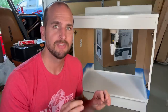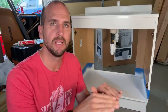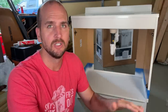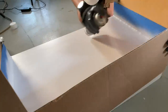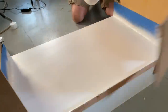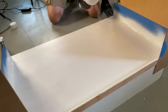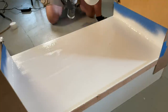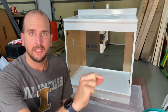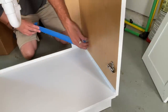The goal is that if there's ever a leak, the water comes out the front of the cabinet where you'd step on it and notice it — rather than sitting in the cabinet base eating away at the bottom or going behind the cabinet and causing damage over time. The second coat is now fully dry and I've removed the painter's tape. I'd recommend using a razor blade to score the bottom of the tape first so you don't peel off the Flex Seal when removing it.